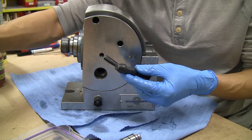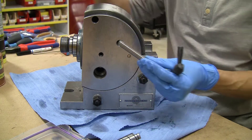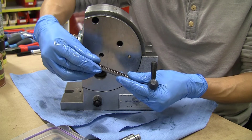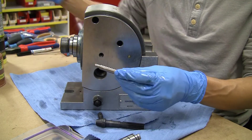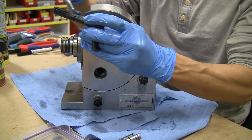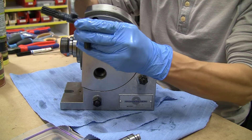Next is the geared indexing pin. The rack does not seem to have any grease on it at all — it was very dry, and there are a couple of little areas of minor rust as well. So I am going to put a nice liberal dab of grease on it and also on the pinion that drives the rack.